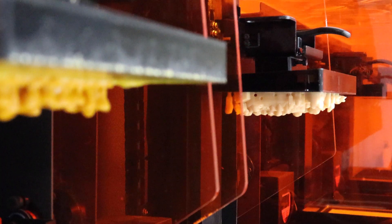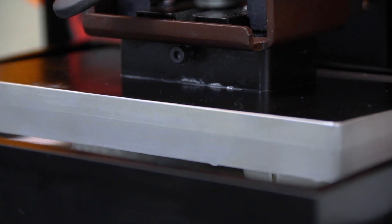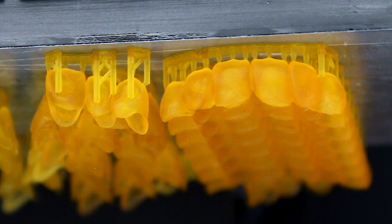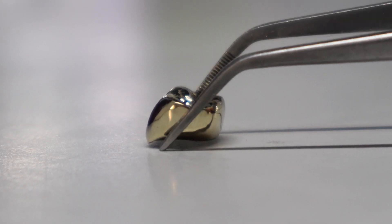Company-wide, we have 7 Envision 1s — 2 in Costa Rica and 5 in Alabama. We're running our Envision 1s 5 days a week, 12 to 24 hours a day. We use them for printing 200 to 300 crown units a day. We're using a one-stage burnout, so we're able to ramp up the heat very quickly without breaking down the investment. And we still get a nice, clean burnout and a beautiful casting.